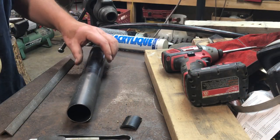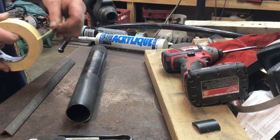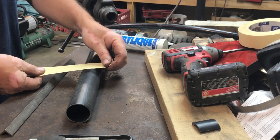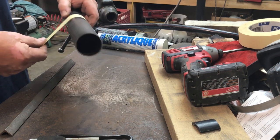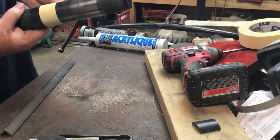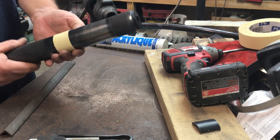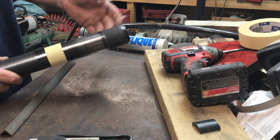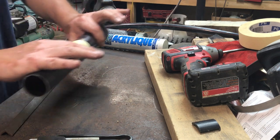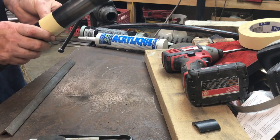I went through that pretty fast over at my bandsaw, but here are a couple simple tips if you're trying to cut pipe. If you want to cut around the pipe, a real simple trick is to take some wide tape, lay it on there as nice and straight as you can. When you put it on, make sure your lines line up. If you cut along that seam, you're gonna have a nice fairly straight cut. That's if you're doing it in the vise with a hacksaw. If you have a flat table to run it through, or you can chop it with a chop saw, you don't really need that as long as your blade is square.